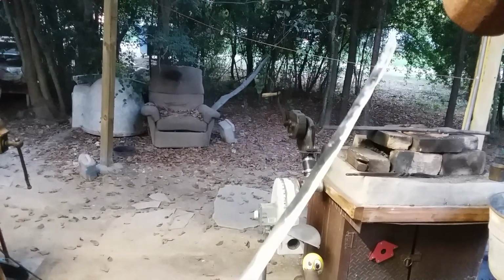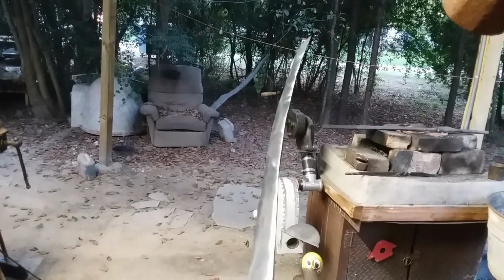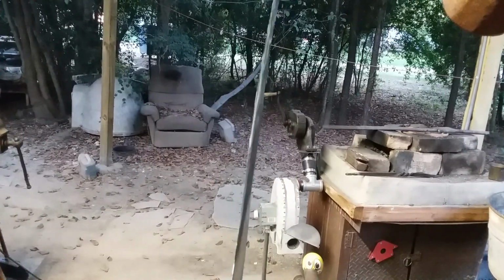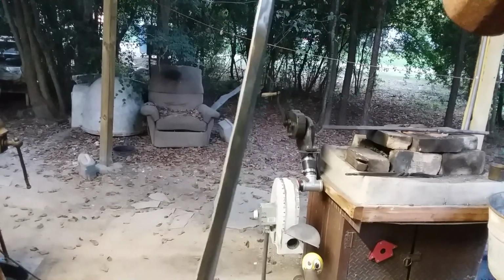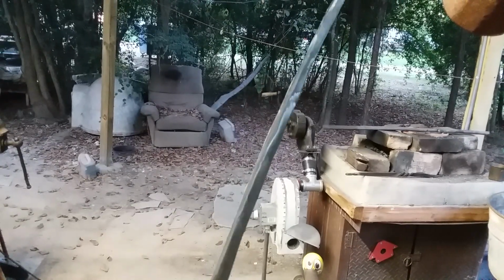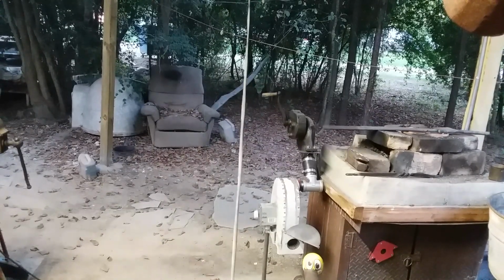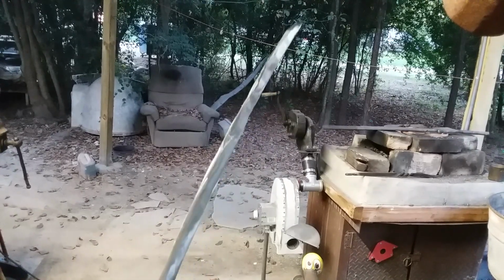Okay, I'm back, and I have run a worn-out 60 grit flap wheel over this thing, and it's beginning to develop a little bit of a shine. Also, it's getting fairly sharp. Of course, the edge gets overfolded, but a little honing is going to help that. I want to do as much work to this thing as I can before I heat treat it. That way, if there's any warpage or distortion, it'll happen now, and I can correct that before the heat treat.